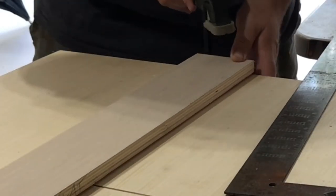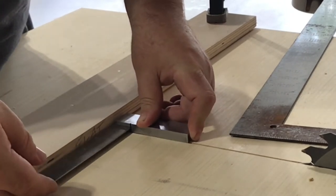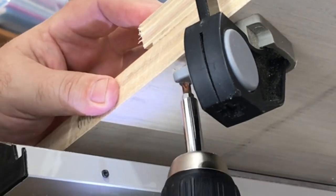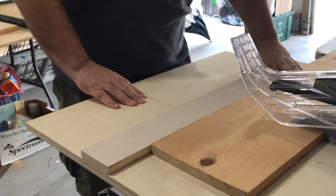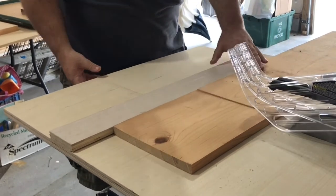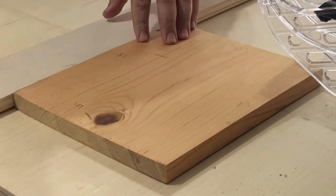I can pivot the fence a little to get it as lined up as best I can, then clamp it into place. I double check it with a more accurate square. With the front fence held by the clamp, I pre-drill, countersink, and screw it into place with a single screw. At this point I cut a rectangle or square piece of wood to use in the five-cuts-to-a-perfect-cross-cut-sled method — this method was developed by William Ng for adjusting table saw sleds to make them as close to perfect as possible. I'll put a link to his video below and want to give him full credit.